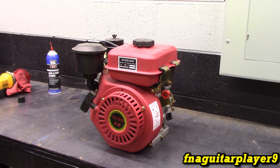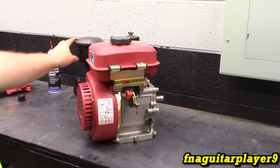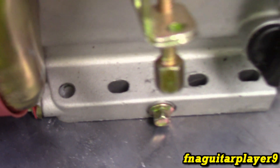This video is kind of jumping around in time with the workbench — you can see it's about midway completed at this point. I just wanted to unbox it and make sure everything's alright. I haven't done anything with it except let it sit and get some dust on it. We're going to put some oil in it, some diesel, bleed the injector, and get it mounted on the engine test stand. I like how it's got a dual bolt pattern on both sides — that could be really handy.